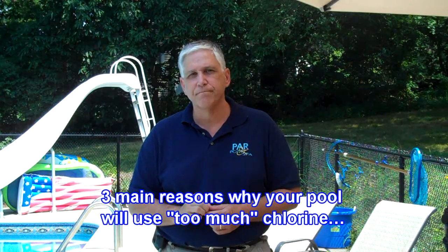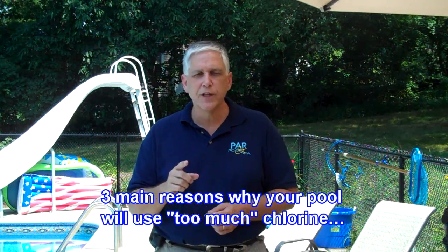There are three basics that we want to take a look at before you start adding cyanuric acid. I can honestly say — I can look you dead straight in the eye and tell you that 99 times out of 100, you are not going to need additional cyanuric acid. If you're using a slow-dissolving chlorine or a granular chlorine that contains sodium dichloro, you will not need to add a second dose of cyanuric acid, stabilizer, or pool conditioner to your water.